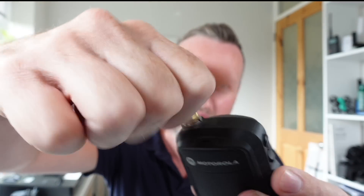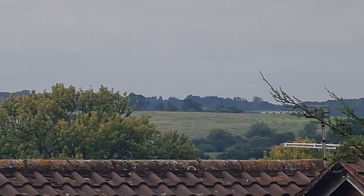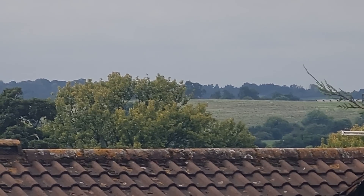Now the interesting bit — we're going to try putting a Wi-Fi antenna on this. To do that you need one of these little reverse SMA adapters so you can screw on a normal SMA antenna. These are common Wi-Fi antennas you'd use to improve your Wi-Fi signal. We're also going to do this line of sight — I'm going to push the boundaries. We've seen that we can't get further than about 100 meters down the road, so let's use these antennas and go to a field I can actually see from my window in the distance. According to mapping it's about a kilometer away — definitely not under a kilometer.